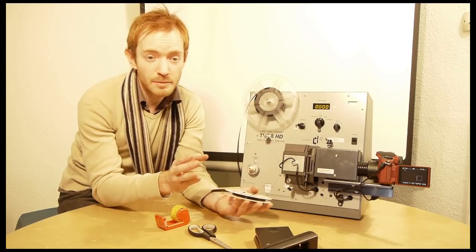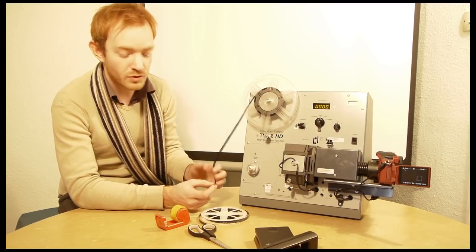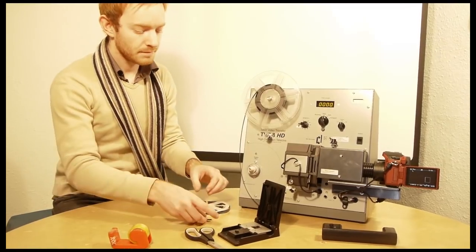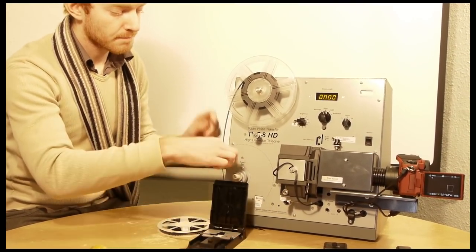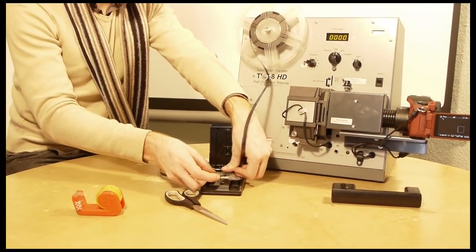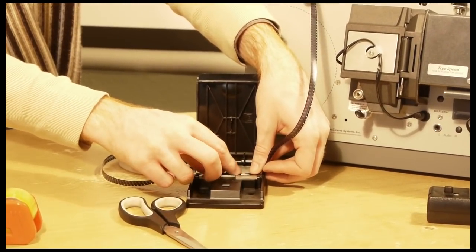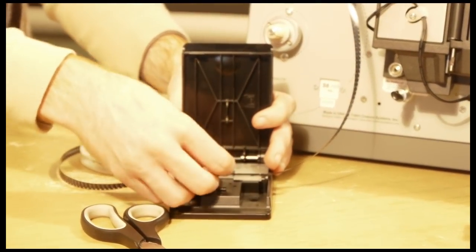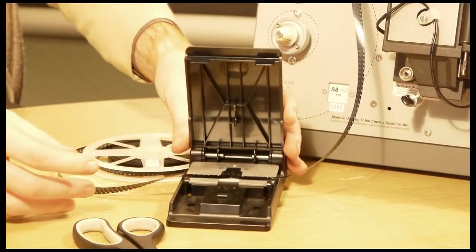First we're going to show you a little bit of a trick, and this is a piece of film that a customer has sent in. Now it's in two halves, so what we need to do is we need to get our splicer, which is this little machine here, and we just pop part of the Cine film in there, trying not to lose as much footage as we can, and the other half in the other side just here. Just move that a bit further across there. Just fit that nice and neat and tidy in there. Just make sure that's in the right place, and now this will create a clean cut down the middle of the Cine film. So there you go, nice and clean cut.